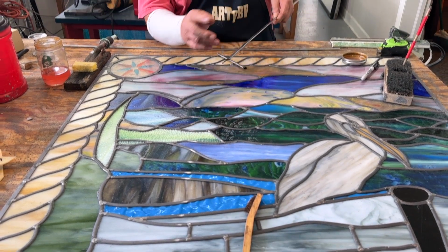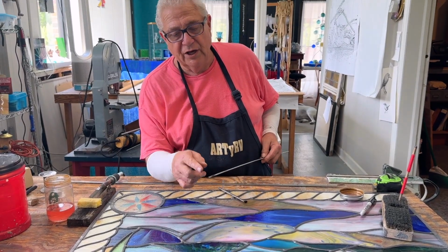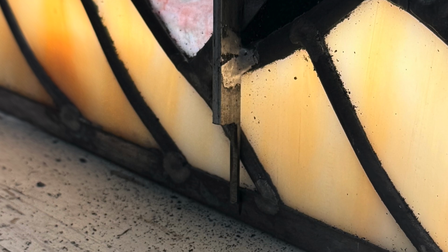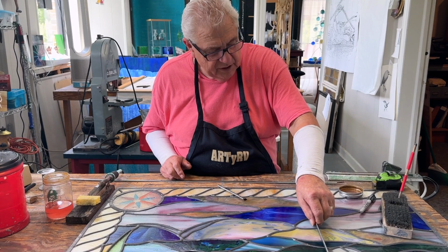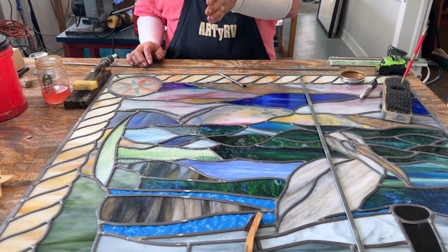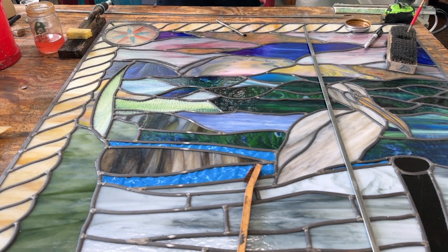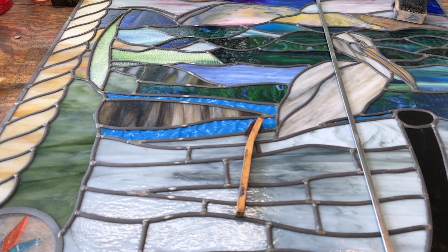So first of all, we've taken them, cut them the length that we need, and we know that we're working with a 1-inch stop on the job. So I've notched out the rebar 1 1/8 on each end. And then I've marked in 12 inches because we want that to be straight. Then I took my brush and laid this out, and wherever I wanted, probably on 16 joints going vertically, I have marked my rebar that goes right here.